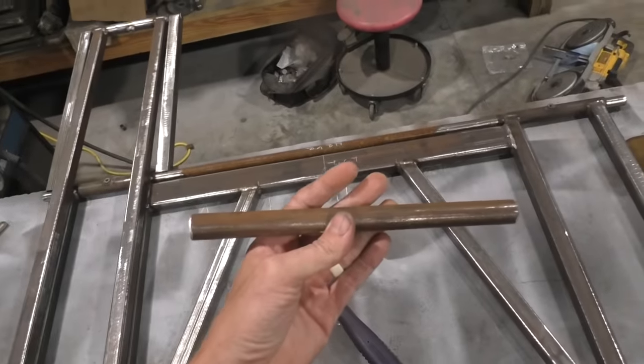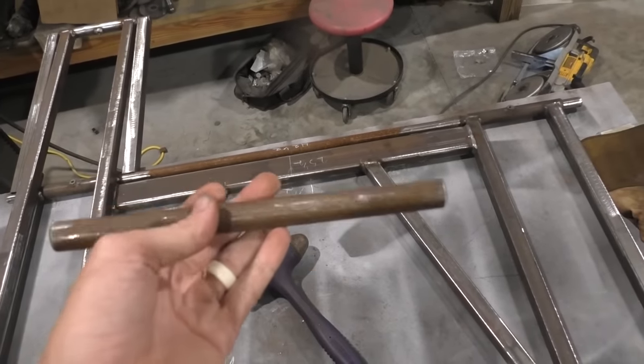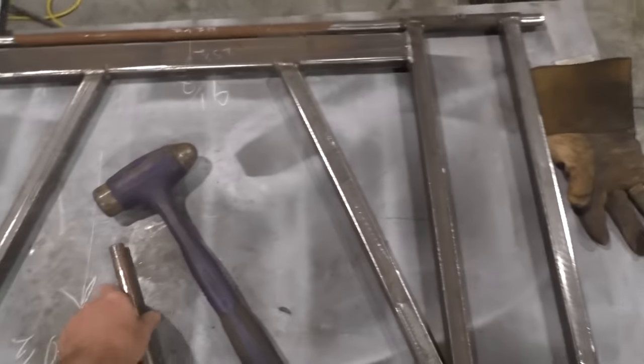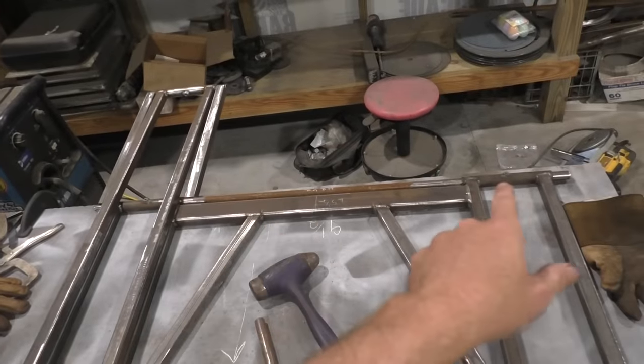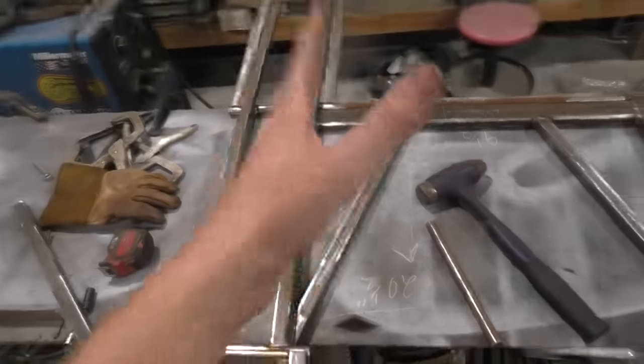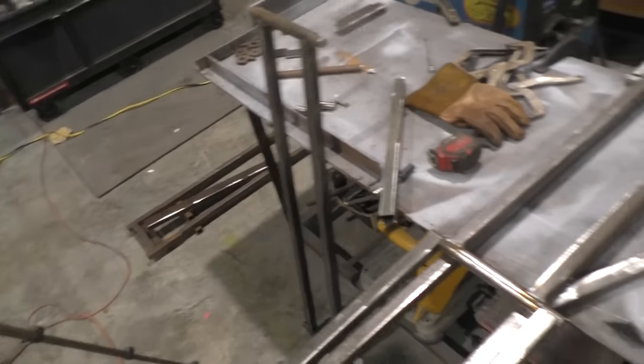All right, so now to get your base built here, go ahead and cut you 6 pieces of 3/4 cold roll, 9.5 inches long. Go and bevel your ends up and, you know, take an old tiger paw to that booger and clean her up some. And what you're going to do is on your base, go ahead and stick you a piece in both fronts. You only need 6 because don't forget you got your long one going all the way across the back. So like I said, we will cut that. And then take your other 2 rails and go and pop them in there. Should have about a little over an inch on each side.